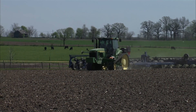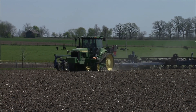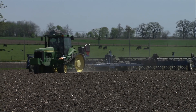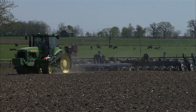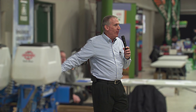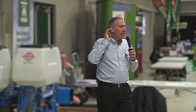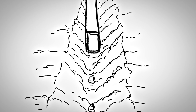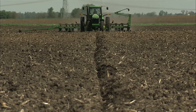So how do we check this? How do we level our planter? You need to do it in motion. You need to get somebody to drive that tractor forward through the field so you can tell if that planter is running level, because if you stop in the middle of the field with the planter down, your down pressure springs will relax and it's going to look level. But the moment you take off again, she is going to nose right back downhill. We want it running level, or pitched high in the front if you are doing it by yourself.